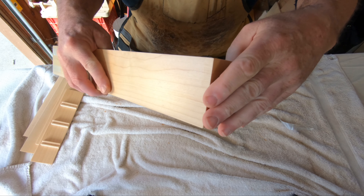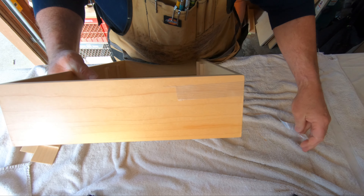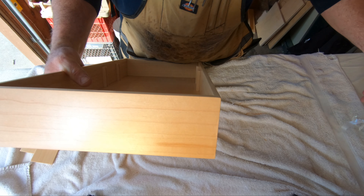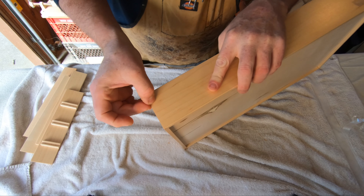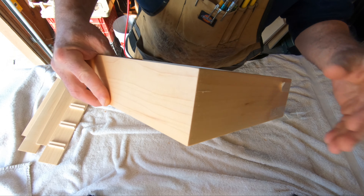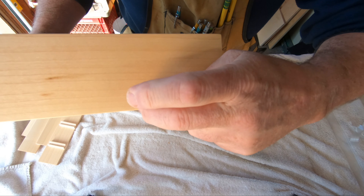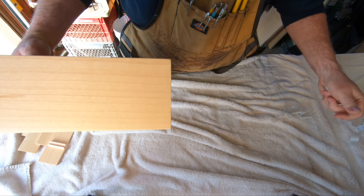Show you the corner — we'll just keep taking the tape off. Usually this packing tape doesn't stick to finish; this has actually been on here for like four days. If you get a little glue squeeze or dryness on there you can just take it off with your thumb, and it comes off pretty good. Like I said, this tape has been on here for days and it really doesn't stick to the finish too much. You've got to make sure you let your finish dry for at least 24 hours before you tape it on there.